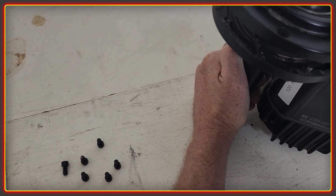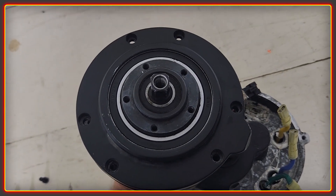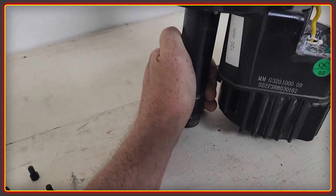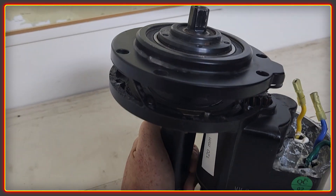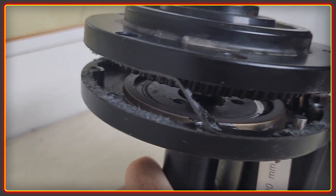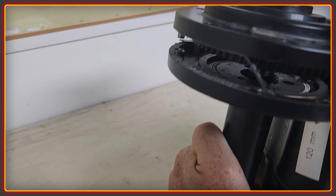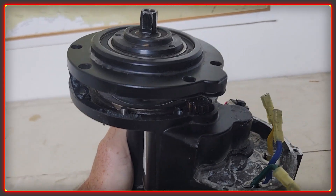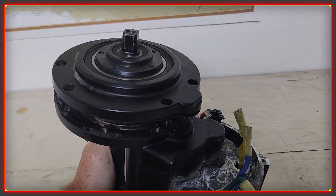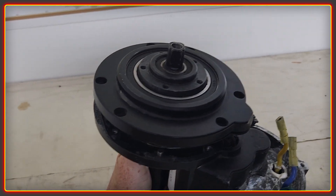With the BBS HD there are better videos than this for taking it apart, but briefly: there are six bolts in the top, and then to separate it all you have to do is give it a quick tap on the table — you can use a rubber mallet. That will separate them. I can see already that it has destroyed the paper gasket, but fortunately I make my own, so if you need a new set of gaskets you can get in touch. Once that's done you can just pull it apart.